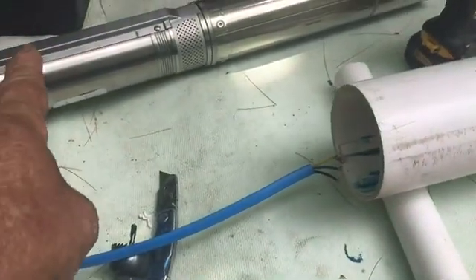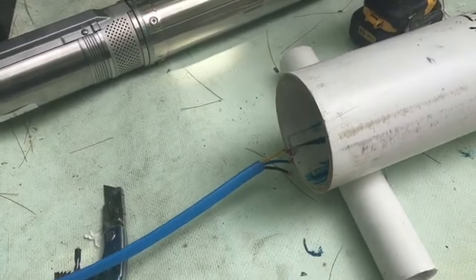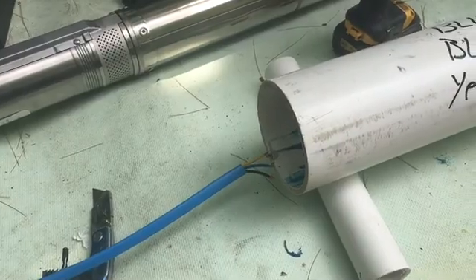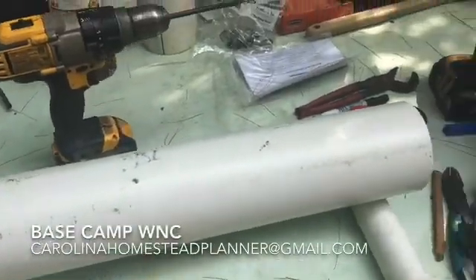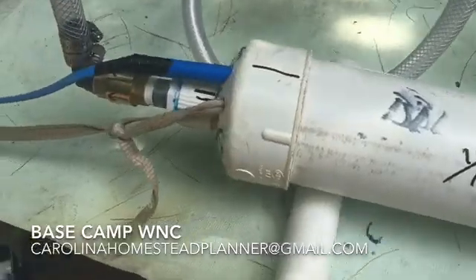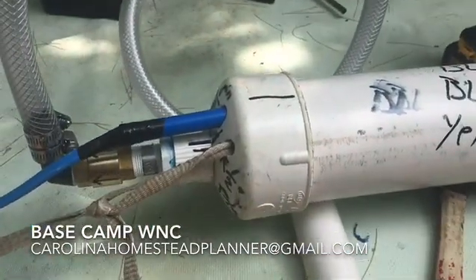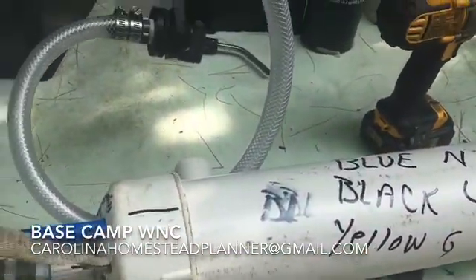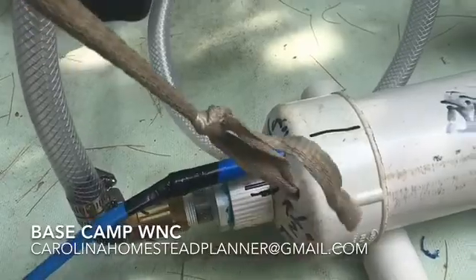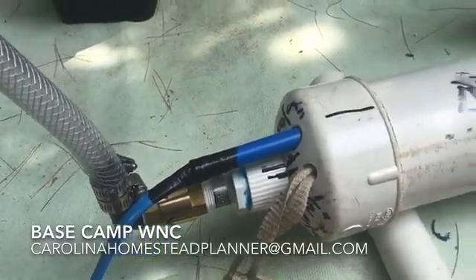All we have to do now is slide the pump down on the strips in here. This cap we just drive on kind of snug with a hammer — we don't glue it on in case you ever have to get the pump out. This way you can just take a hammer and tap it back off. Here it is — you can see the back end sitting on those two strips. Now it's ready to go down into the cistern. The power line is protected, there's a pull cord if you want to pull it out, and this is the hose that will come out the top of the cistern for the output.